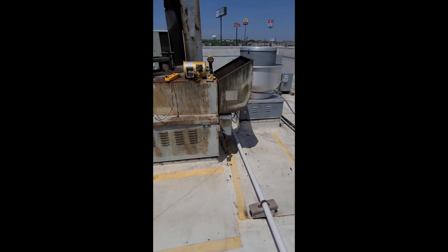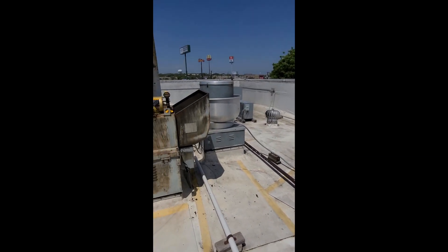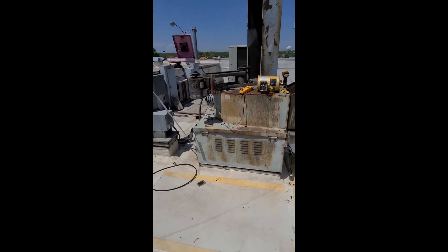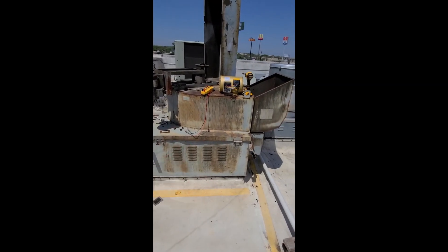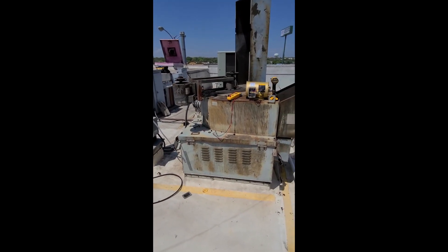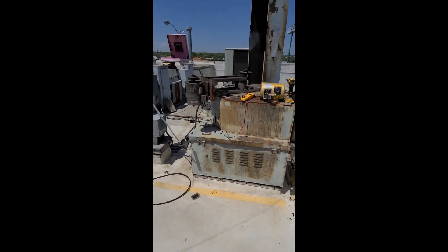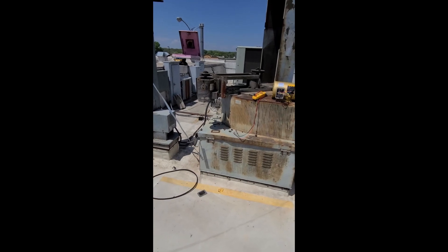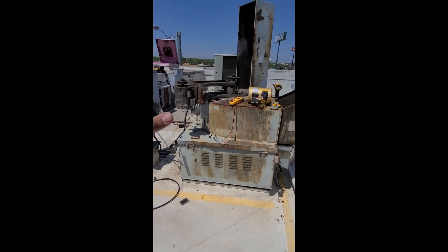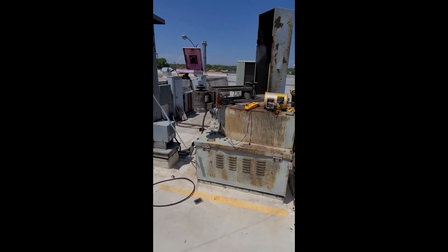Today I have a vent hood motor. The kitchen here has a lot of smoke — the complaint is they can't breathe, it's too much. The ACs are working but above the fryers the smoke is unbearable. I came to a service call a few days ago; this breaker was tripped for this main vent hood motor. I reset it, it ran for a few minutes, and then it started sparking — the windings internally burned up. It's a three-phase motor, so the motor's bad.